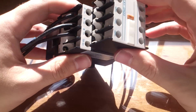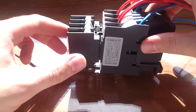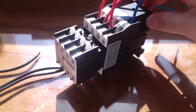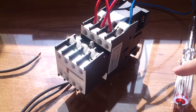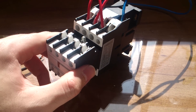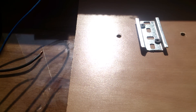Make the connection — now I have connected the auxiliary block to my contactor and have a complete contactor ready for use. Thank you for watching. One more thing: I can also mount this contactor onto a DIN rail rack. I have another rack here and you can see that this contactor can be placed and connected onto the rack.